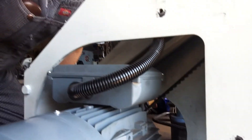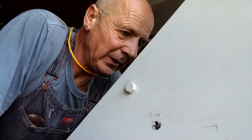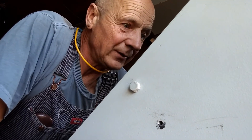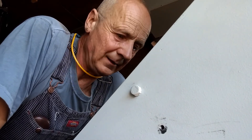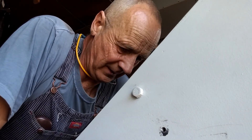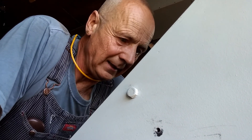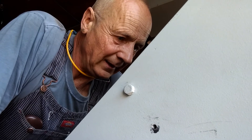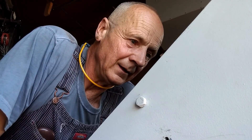If you have an old machine and you got oil on the belt, that's okay — belts can be oily — but you may have to tighten it a little more. If you tighten it too hard, the motor will start making funny noises; that's a sign the belt is too tight. If it's too loose, it'll slip when you push the foot pedal. Find the right middle ground and have fun with your hammer.